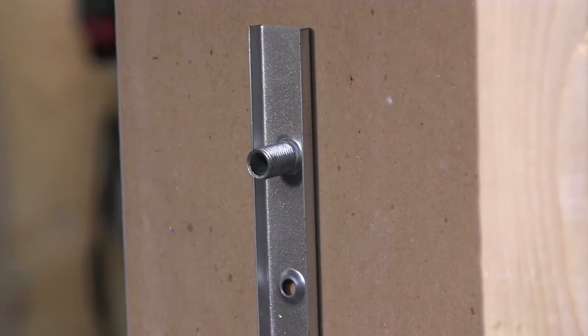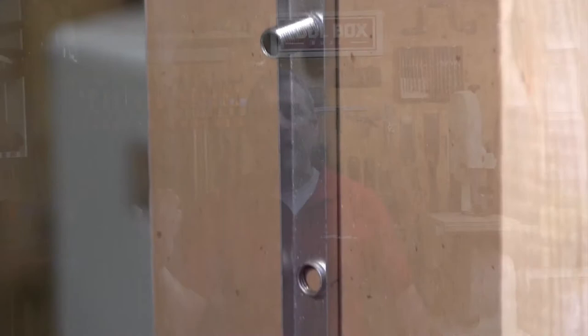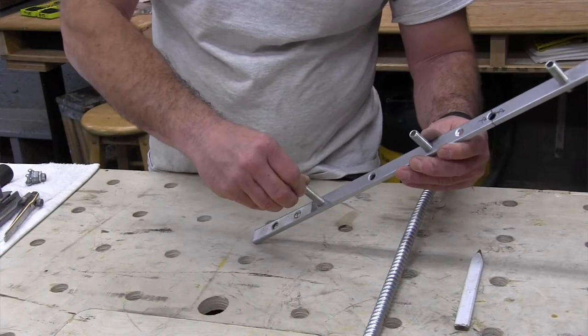Warm-Up provides a metal mounting bracket that is used to hold the wired side of the towel bars to the wall from the back side — that's why you need access to that wall cavity. The mounting bracket accepts a 3/8-inch threaded nipple, one for each towel bar.